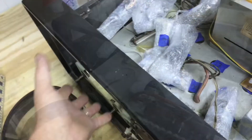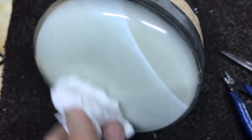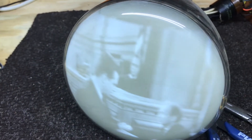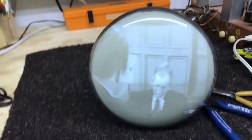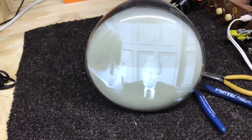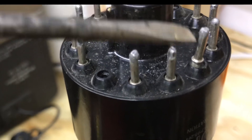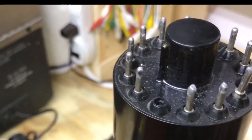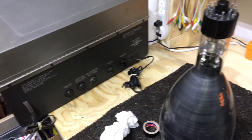Taking the knobs off and the front panel off, I was able to just pull the tube forward. A bit of dust on the front of this one, but I see an image - looks like we've got a decent tube here. Checking the focus - not bad. Again, that's with overhead lights on, so that'll definitely work. The only issue this tube has is that a pin has popped out of the base - we'll either try to put that back in or just change the base on it. Number eight: good tube.